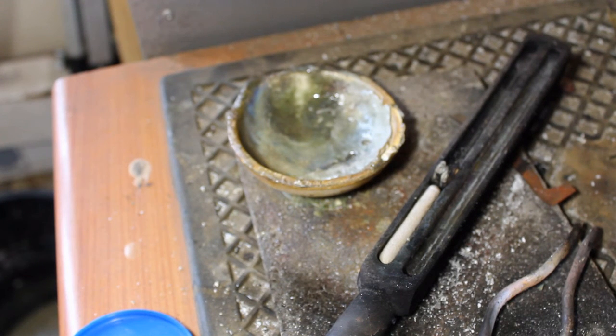You can clearly see now after melting for the third time there are no bumps or irregularities on the surface of the metal in the ingot, which means you can be pretty sure that the mix is properly mixed. There's no palladium in its pure form anymore — it's all mixed evenly with the silver and the fine gold and it's ready to use for jewelry manufacture.